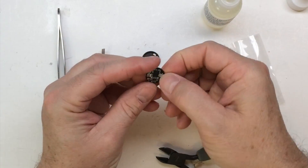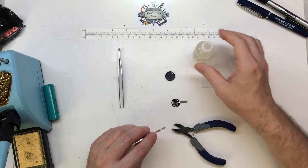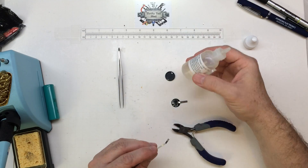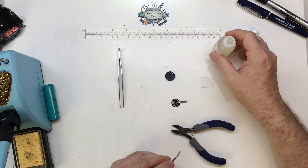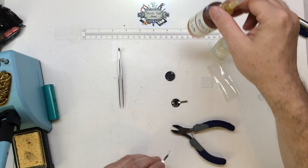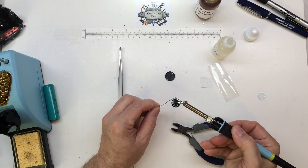There's our B minus tacked on. We'll do the same thing for the B plus — that'll be our longer connection. A little bit of no-clean liquid flux. It's not as good as rosin flux to me, but it doesn't make as much mess to clean up. There might still be some cleanup, but not bad.